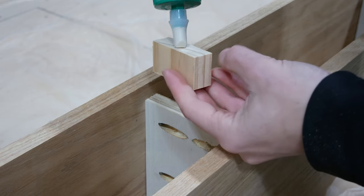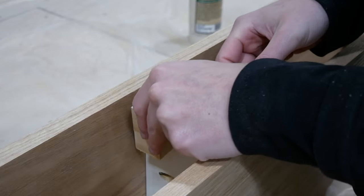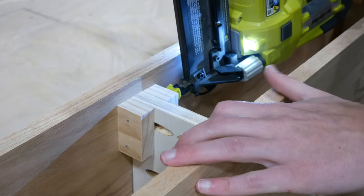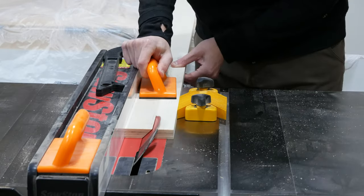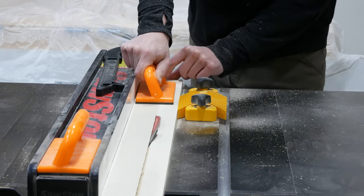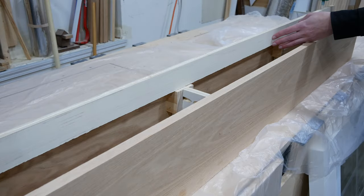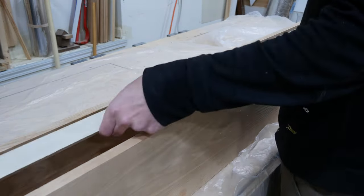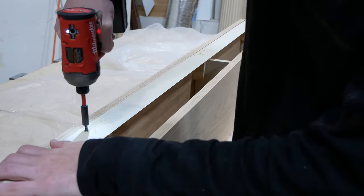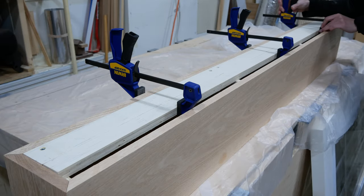I glued and tacked some small wooden blocks to the sides of the frame pieces at the top of the beam to give me something to screw a French cleat to — I wouldn't need these blocks if I had made the frame pieces from solid wood instead of plywood. With the glue on the beam drying, I took a 3 and a half inch strip of plywood and ripped a 45 degree bevel so that the two pieces are roughly the same size. I added glue to the top of the French cleat and the screw blocks, then pre-drilled, countersunk, and added a wood screw at each screw block location. I used the lower half of the cleat to clamp the top half while the glue dried.